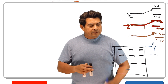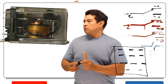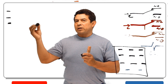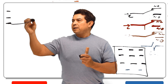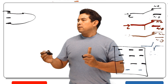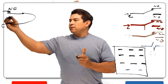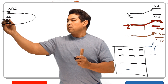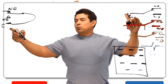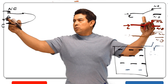What tends to happen here is that on this relay, if you look at the side, you have a connection on it like this — a connection here, a connection here, a connection here. As we look at the side, we see that from this connection, there's a little wire that comes out and it goes to this little metal piece. This metal piece has a set of contacts. So this would be like your common right there. This up here would be your normally closed. And this other one here, that would be your normally open. This is your common here — that's where power will go in. That little wire is going to take it up to this one where it's going to be normally closed, and then this one here is normally open.